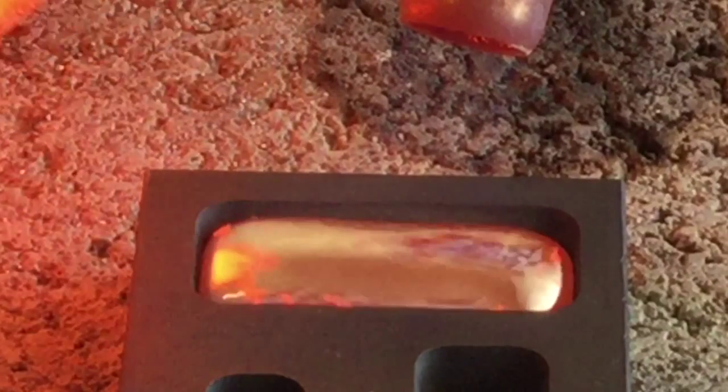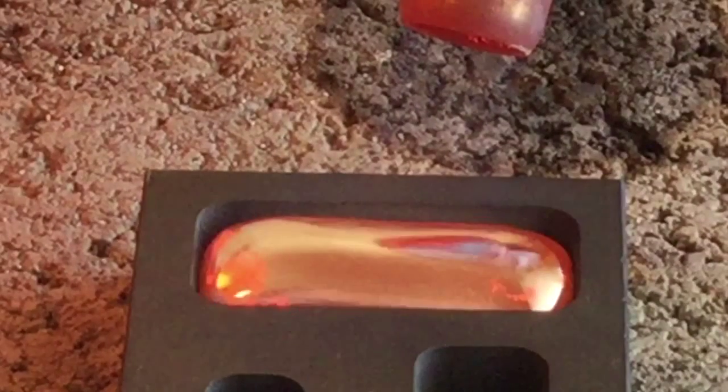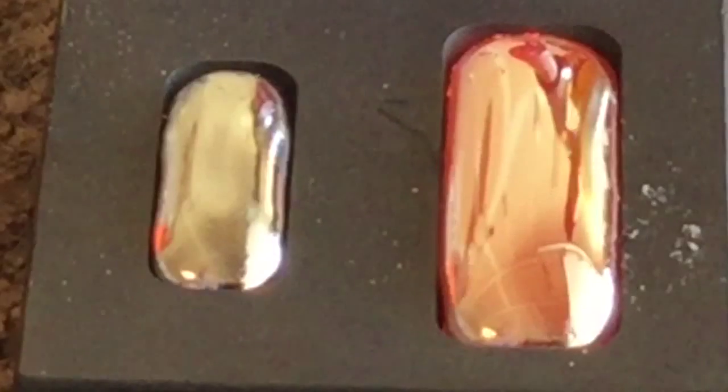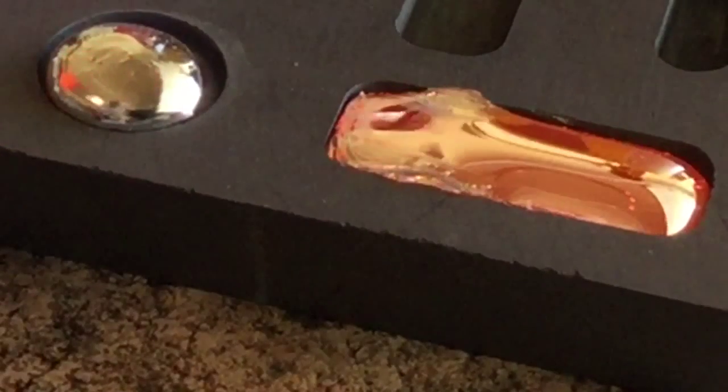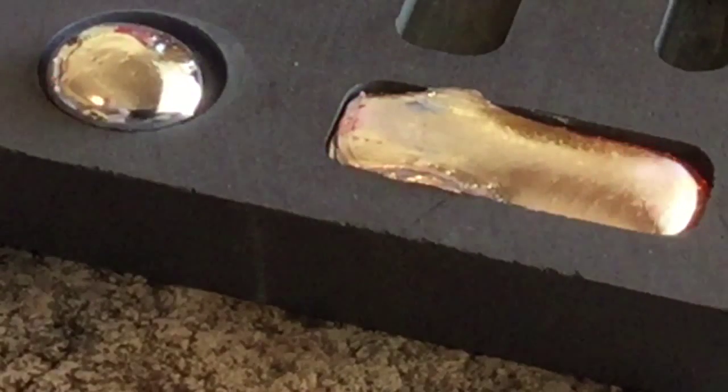The silver is reheated and I'm just going to go through a series of slow-mo. You can see I'm trying to create that side-to-side motion with the torch. If it's too hot, the motion kind of settles too much before it cools and you get more of a real fine pour line. These particular bars are very small. Going more side-to-side motion, it cools very quickly — it's hard to create really exciting pour lines on the smaller ones. That one there is about a half ounce and I was able to do it with that. You can see how it's cooling here on the hot spot to the right.